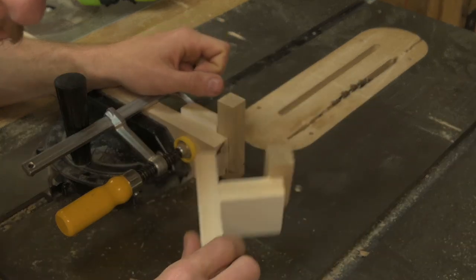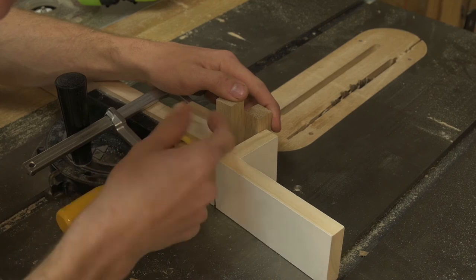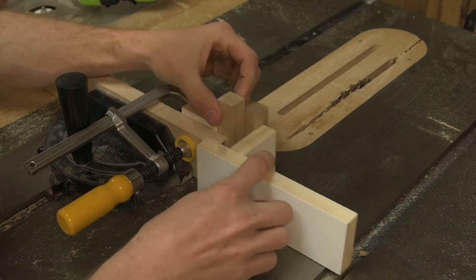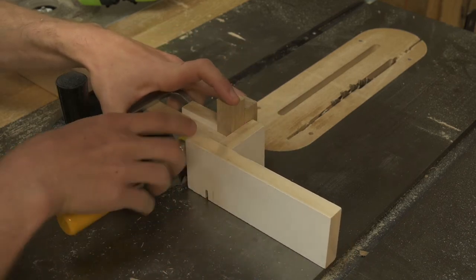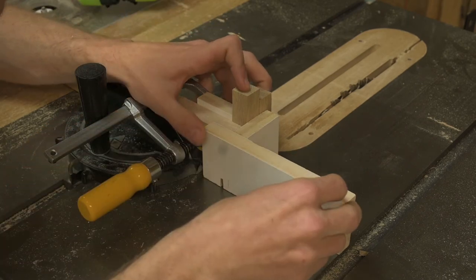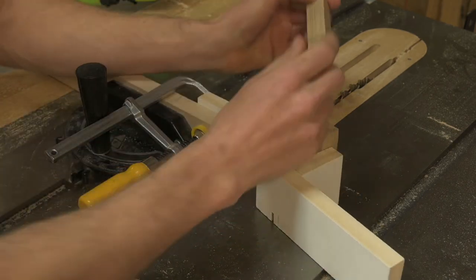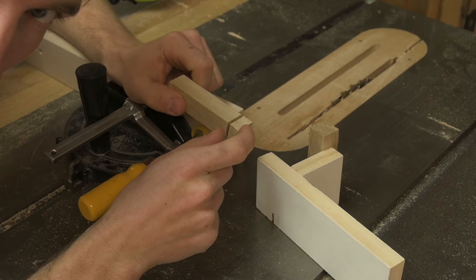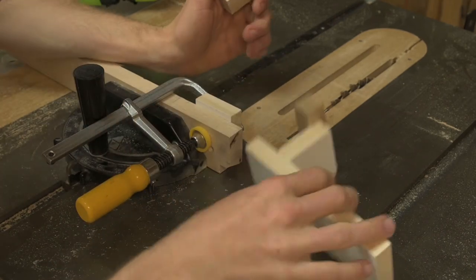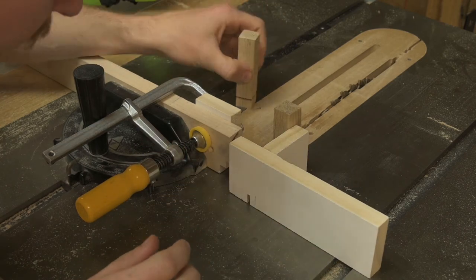The jig clamps onto the back of the miter gauge. This piece pushes the workpiece tight to the stop block, and the front piece holds it tight laterally so it can't move at all. I lock the piece in, push everything down, and my hands are on top — not close to the blade. We just run it through: four passes, one per side, instead of three passes to hog it out the old way which was 12 passes per piece. It really cuts the time in half. Throwing this together took no time at all — just some thick CA glue and accelerant.